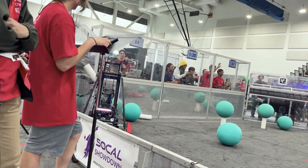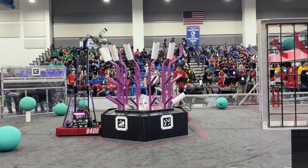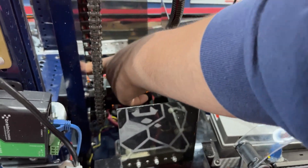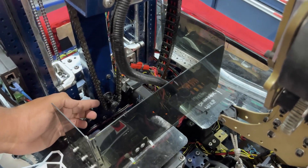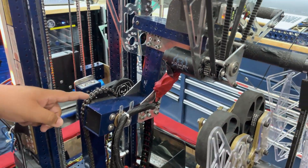Going into our carriage, we have a Kraken X44 on a 66-to-1 gear ratio. It outputs in this direction through a one-to-one gear — that's a 44-tooth gear — and then outputs over here to a 35-chain sprocket that attaches here.